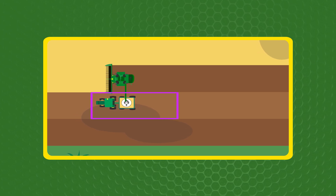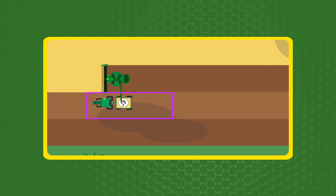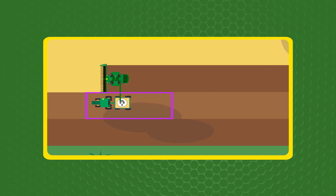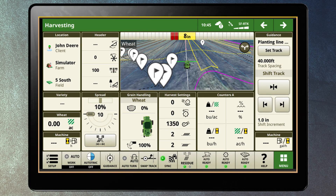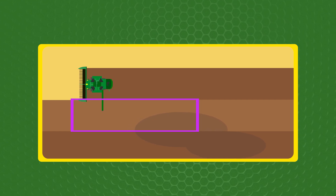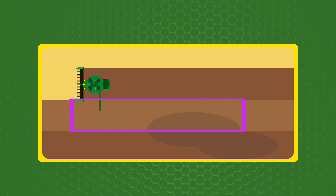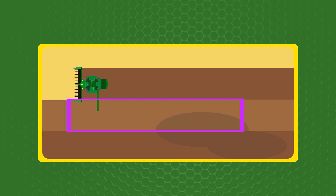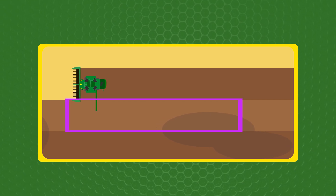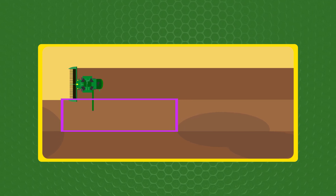Only when inside this zone can Machine Sync be engaged by the follower by pressing the Auto-Track Resume button. If Machine Sync is engaged, the Machine Sync shortcut key will indicate a blue LED. The operator can adjust the Machine Sync operational zone box dimensions to be larger or shorter than the default — enlarging the zone to ease engagement, or shortening it to more accurately connect with the right combine of a fleet harvesting in a staggered configuration.